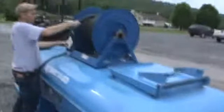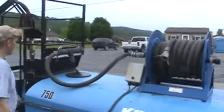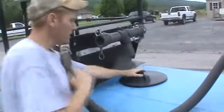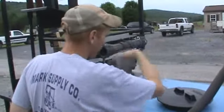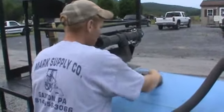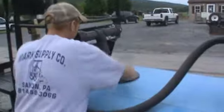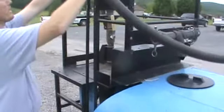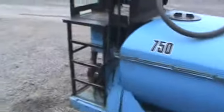We'll bring it all the way around. The hose reel and everything works just the way it's supposed to — no leaks at the swivel joint that we found. A nice thing with this machine: you can actually run a two-inch hose up here to it. You can take this top off and fill it out of a stream or hydrant from both sides, which is very nice — it's already plumbed for that. When you hook up the hose reel, all you simply do is bring the tower around; it couples right to it and that allows you to go to your hose reel.